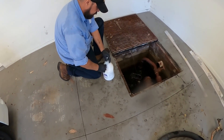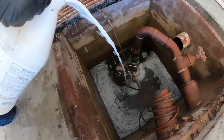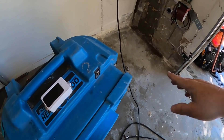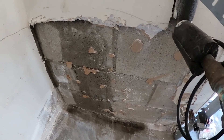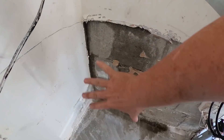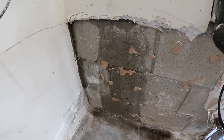Now that we've flushed everything out, we're going to go ahead and put our enzyme in — this will neutralize the odors as well. Smelling good now. I'm going to push some air with the air scrubber and dry this area out while we go to lunch. That way when Raul applies, we get all this straightened out and then coat all of this really well with a good sealer.